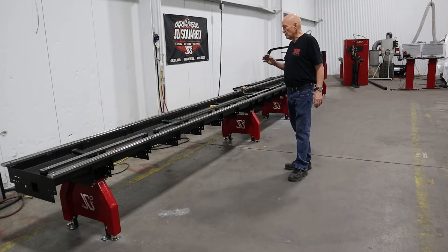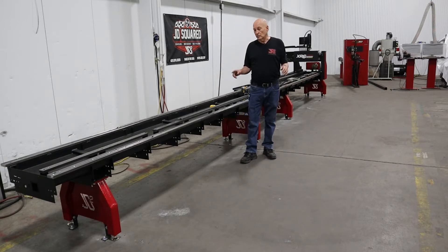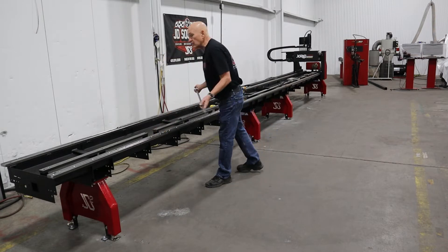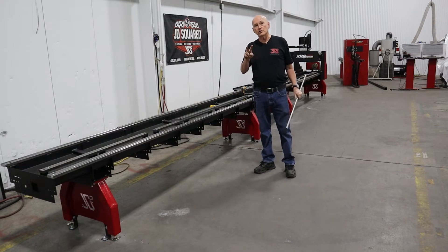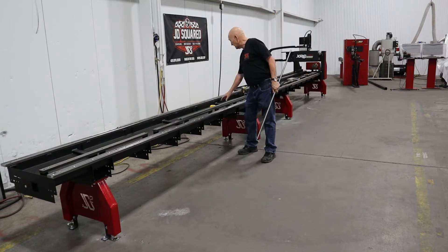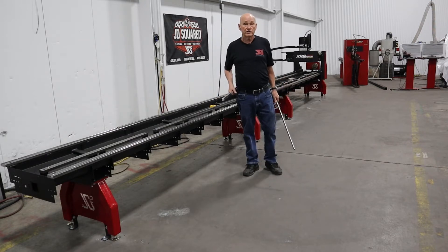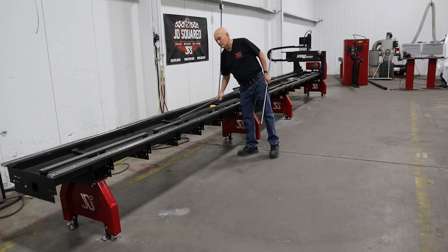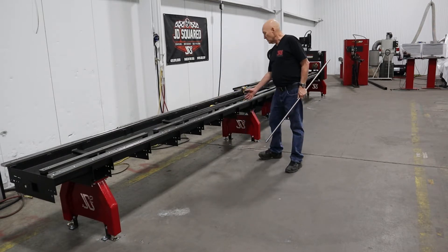In this video we're going to install the gear racks and the round rods. Each machine comes with six three-quarter inch round rods — two short and two long — and same with the gear racks. Notice how heavy and big these gear racks are. Here at JD Squared we build things to last; we don't want to nickel and dime you in support over the years because we built the machine light duty. Everything is heavy duty.